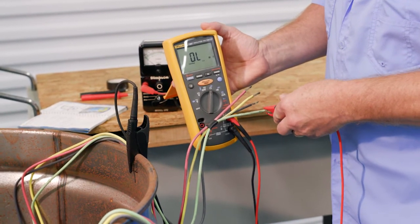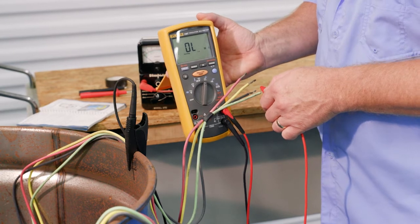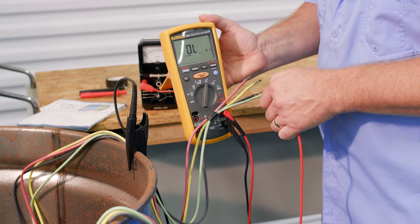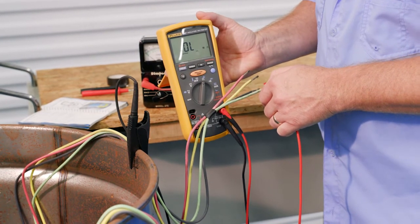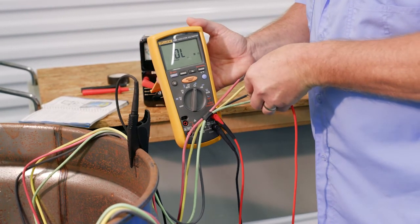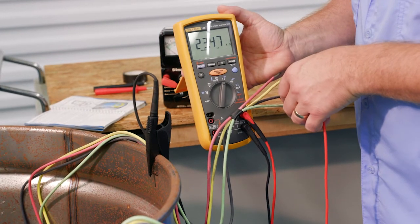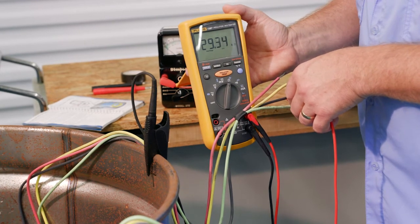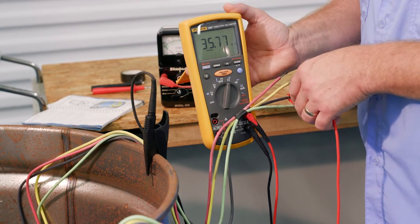Let's do a comparison. If we go on a lead without an issue — we know the green wire is not nicked — just for reference, we can see that it reads OL, which is an open lead, meaning you have no connection between your two leads. Here one is on the green and the other is on the steel barrel. Going back to the black, sometimes the reading will move around a little bit, but clearly we don't have an open — we still see that issue on the black wire with the multimeter.